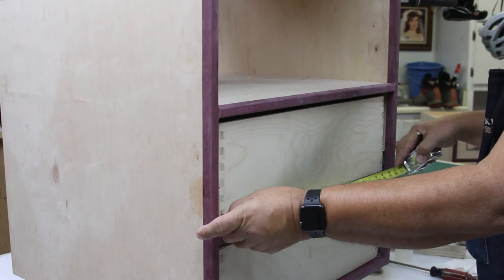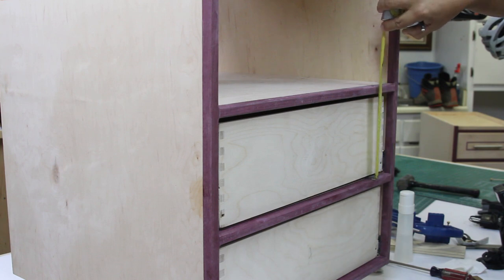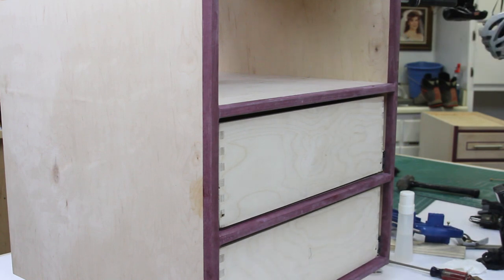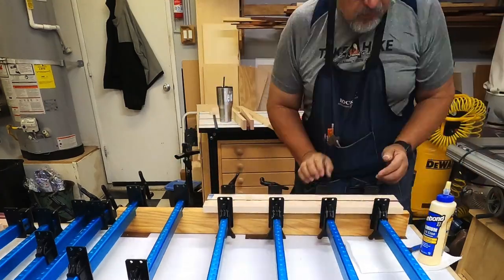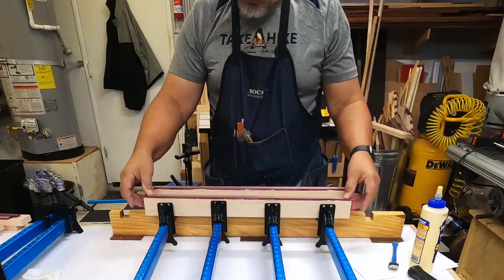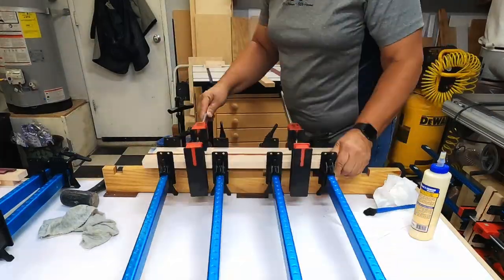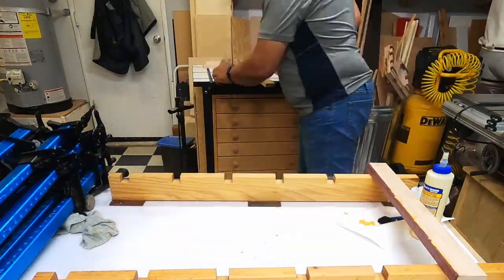I take a quick measurement of the drawers so I know exactly how long they should be when I cut my 45s on them. I'll cut them to the exact length so they just barely fit inside - I want them to be a little bit tight when I cut all the pieces. Purple heart tends to twist and turn a little bit when cut that narrow, especially on longer pieces, so shorter pieces are a little easier to work with.